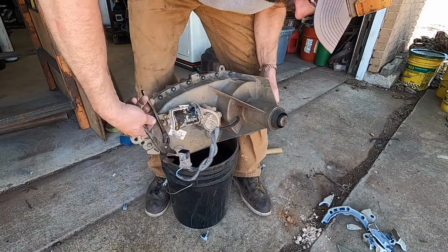But I don't feel like we really did this justice. And so I've went ahead and prepped another billet like the one we just did. But this time I'm going to clean off the chain with acetone and get it really clean. And we're gonna fill it up with powdered steel. And that should take care of all the voids when we go to forge weld it together. It should give us a nice solid piece of steel. And then we can go ahead and do the twist on it. And I think it's gonna make a really cool pattern. So let's see what this looks like. And then we'll proceed and try to do the best we can with this project and finish it out.